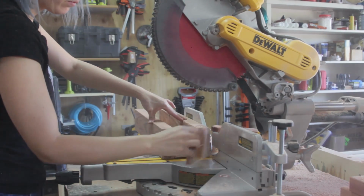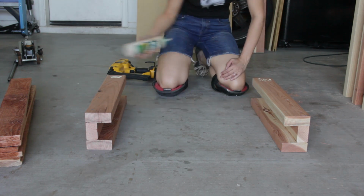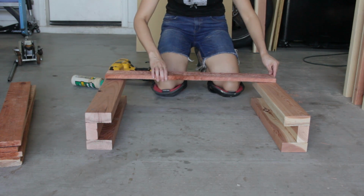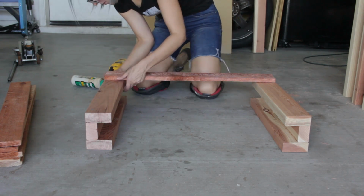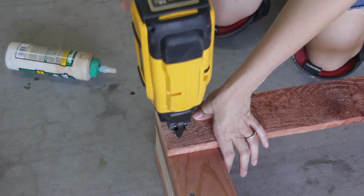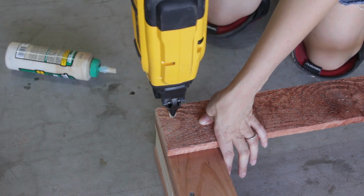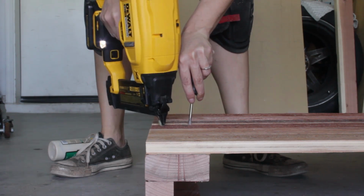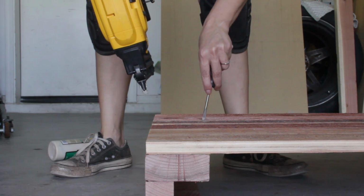The fence picket siding works as kind of an exoskeleton to hold the legs of the arm assemblies together. Using more glue and 2-inch galvanized brads, I started to connect the legs of the arm assemblies together using some of the fence pickets. Before attaching all the boards in place, I measured opposite corners of the assemblies just to make sure they were all square.